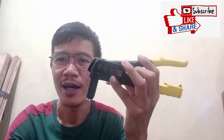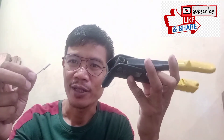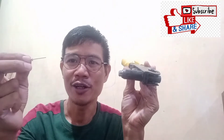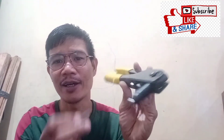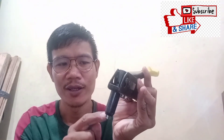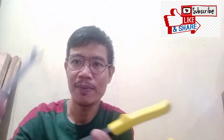So as a sort of review: this is what we call a hand riveter, and these are rivets. Rivets come in different sizes, and you need to check if your nozzle is fitted to your rivets. For the parts, we have the nose, and then the nozzle — these three pieces are what we call nozzles. Then the head, and it's supposed to have a lock and a spanner here, but this wrench is my replacement for the spanner.